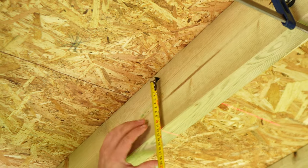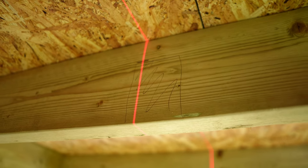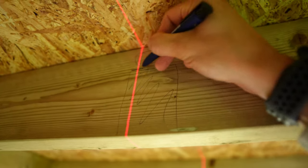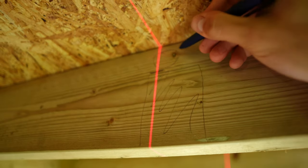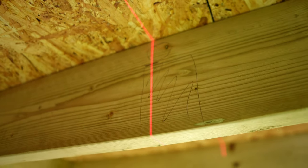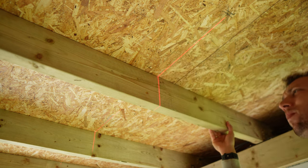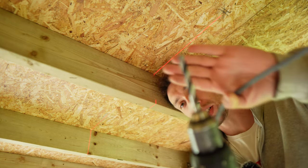I'm going to have one row of four spotlights running down each side of the workshop symmetrically. Using a tape measure and pen, I mark up 70 centimetres away from the side wall on both ends, then use a laser level to make marks along the entire row. I'm being careful to remember I still need to put 100mm of insulation on the bottom of these joists — so when I drill the hole to feed the cables through, I want to go above that insulation, right at the top, so it doesn't interfere. I also need to make sure I don't go so close to the OSB board at the top that I drill through the roof.